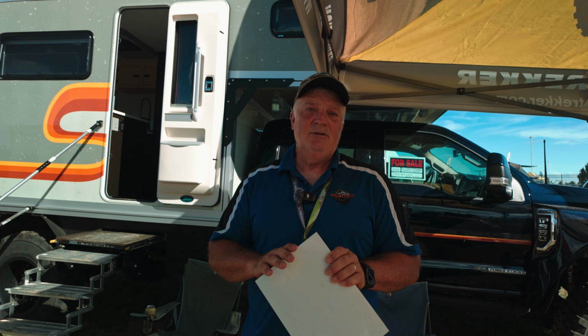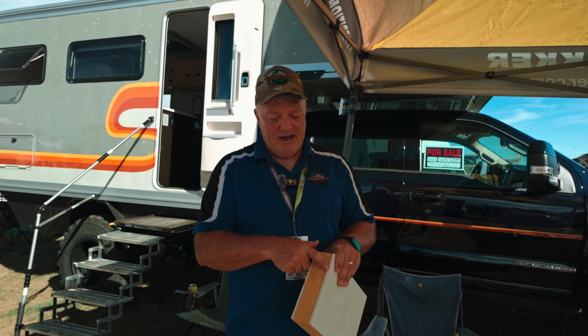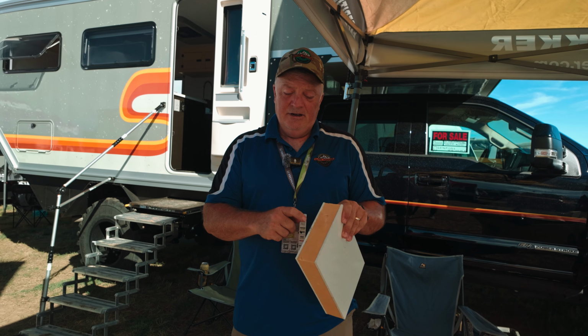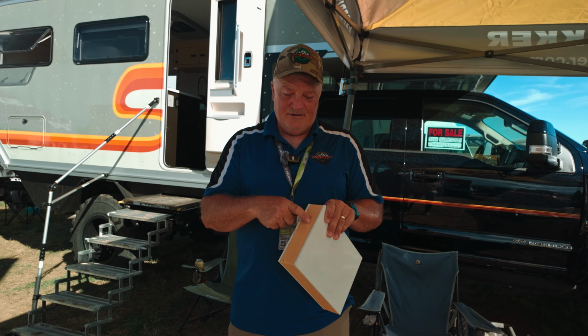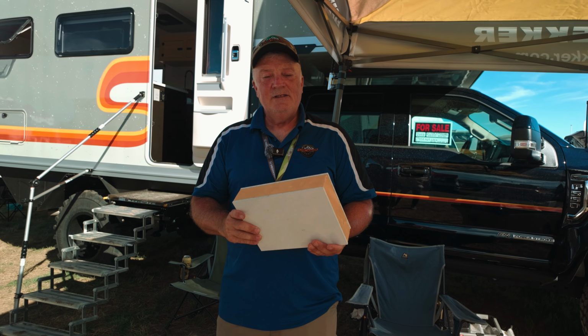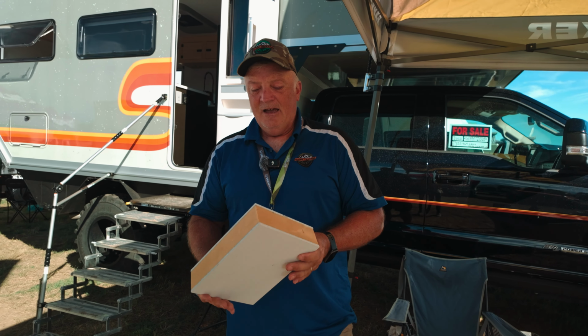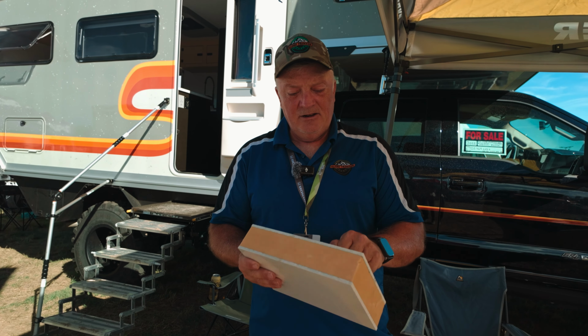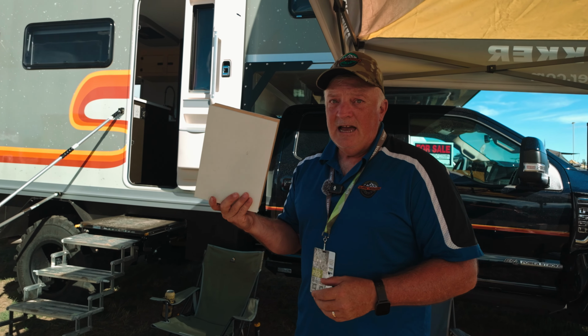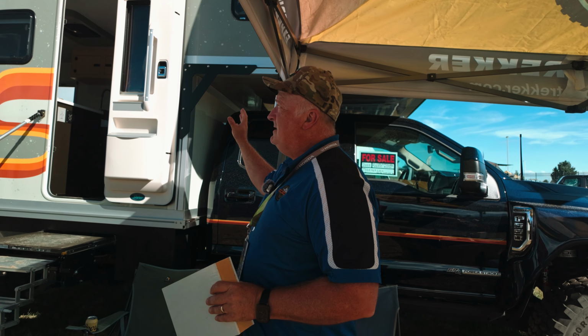There are some panel manufacturers that you can only do in white, because if there's a different color here, the temperature ranges will start to delaminate it. We know that's a problem, so we solved that by having a sub-laminate underneath our laminate. So it goes hard to medium to soft to medium to hard. And that is one of the secrets of our recipe. So this being a true SIP panel, it's very strong and fairly lightweight still. So that is what this is made of.